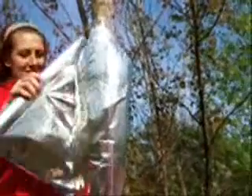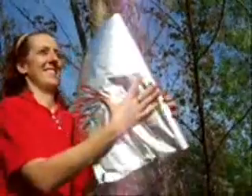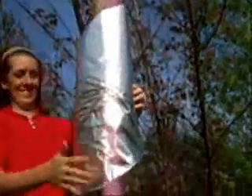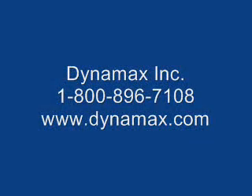To prevent animals from chewing on the cables, we recommend you elevate them. You may also obtain slotted conduit cable wrapping from a hardware or electrical store, or bury your cables to protect them. Be sure to set the power to the sensors correctly by following the specifications and directions provided with your sap flow system. Now you are ready to take readings and to install more sensors. Good luck, and call Dynamax if there are any questions or you need assistance at 1-800-896-7108.